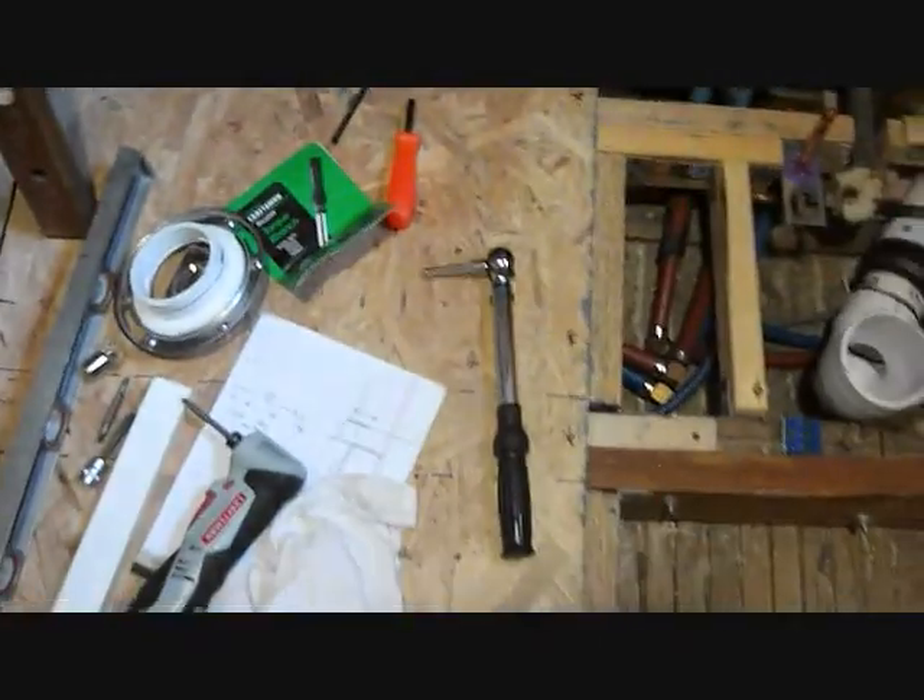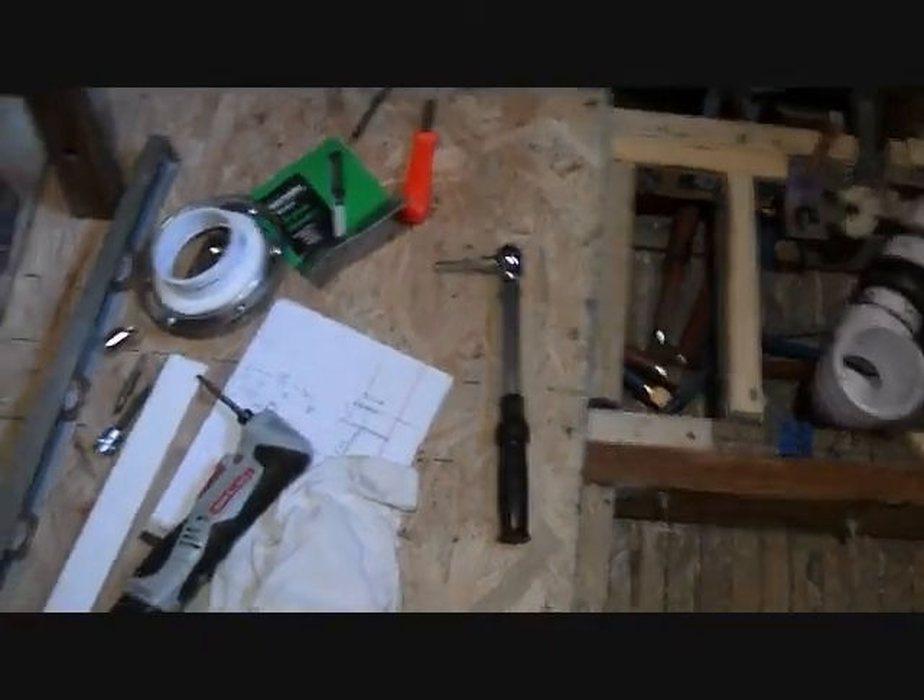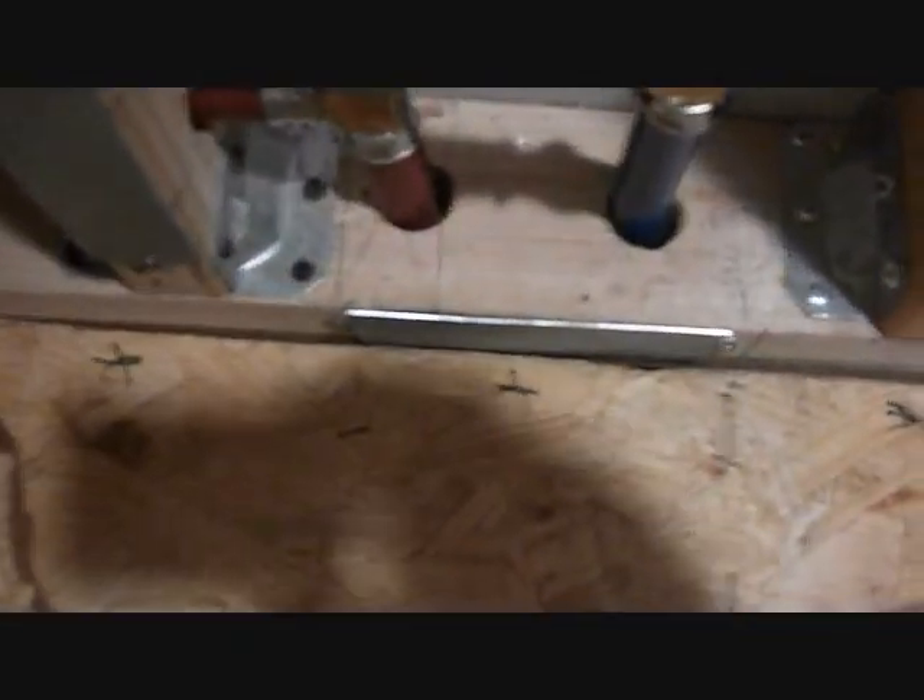That's my small torque wrench set to 60 inch pounds. One thing I did today was I moved all the stuff — the toilet and the sink out; the toilet's in my bedroom. I marked all the floor joists here, following a screw schedule for the floor — you can see some X's there — 6 inches on center for screws around the perimeter and then every foot along the joists. I marked out the joists because they're totally not standard.